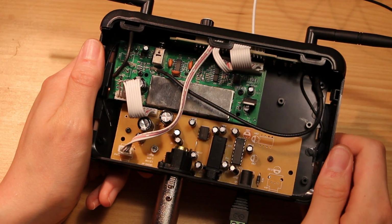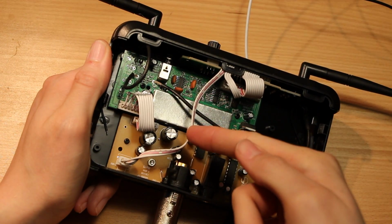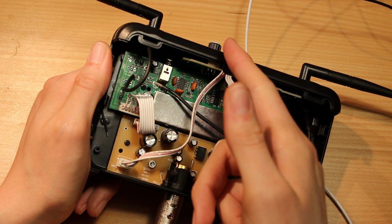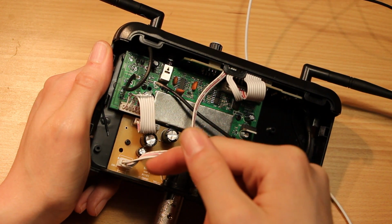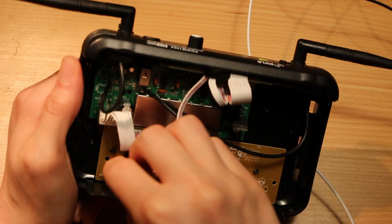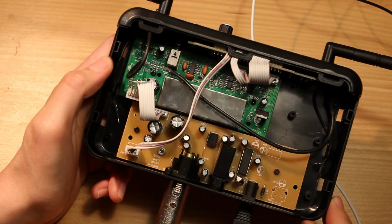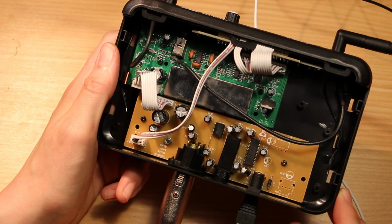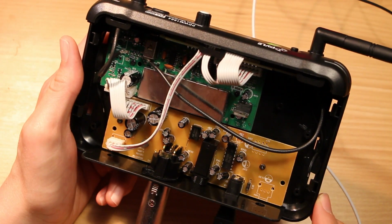Alright, after getting our bearings in this thing, I think now it's time for some experiments. This little 3-pin wire runs right from the attenuation knob up here all the way to the back. So I'm curious if the hiss persists when I unplug this cable. The hiss is a little different, maybe slightly. My microphone's muted, of course, but the bulk of the noise is coming through for sure.